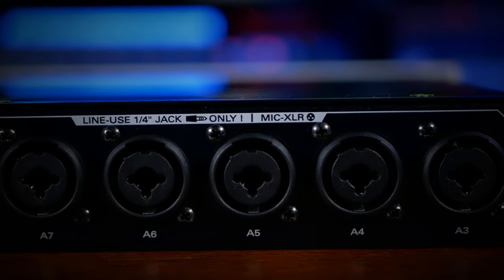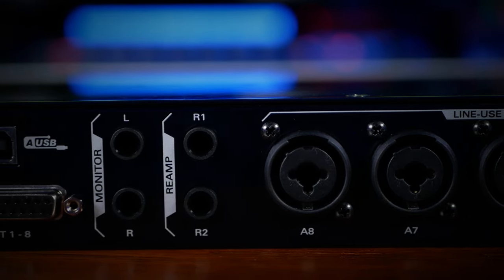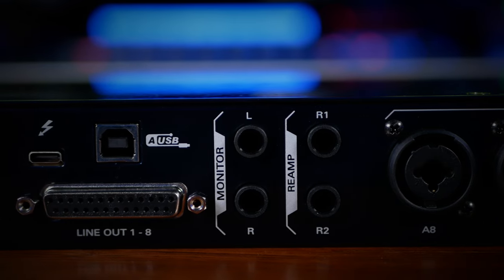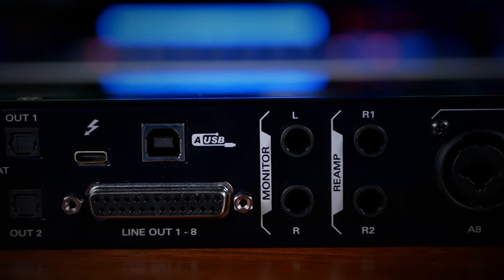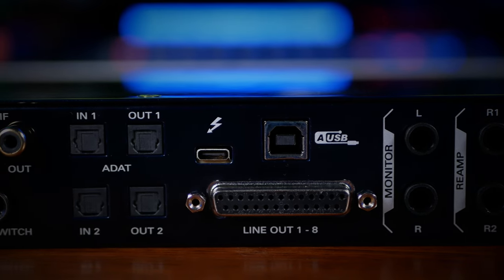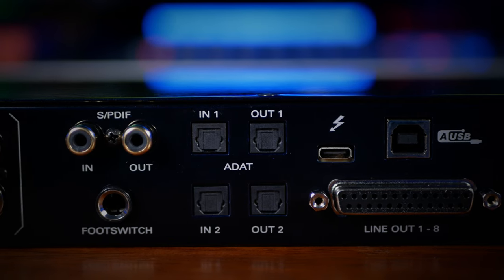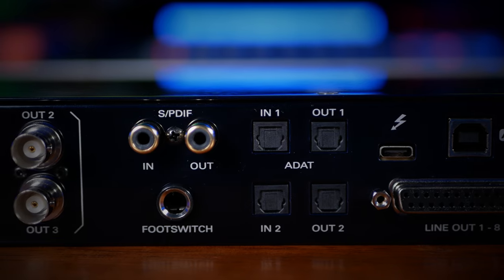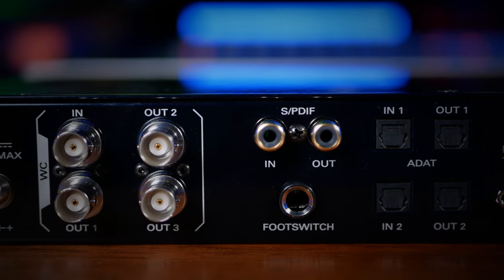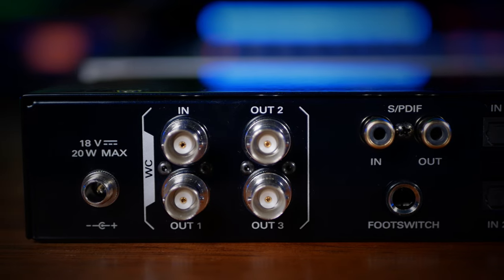At the rear, we see the remaining six connections for our preamps, alongside our two main outputs and two reamping outputs, which can also be assigned to alternate speakers. Another eight outputs are available via a D-sub-25 connector, which saves space, as many connectors may not often be used — but they could be used for additional headphone mixes, effects loops, or additional monitors. The unit can connect to a PC or Mac via USB or Thunderbolt 3, giving added flexibility. Our four ADAT and two S/PDIF connections are what pump us up to 26 ins and 32 outs. We also see a connection for a foot switch to activate talkback, and finally our four word clock connections and power connector. Word clock becomes important when connecting several digital devices together, ensuring they stay in sync and avoid artifacts.